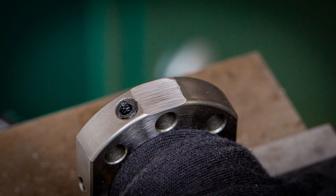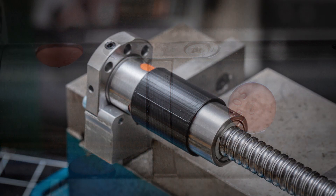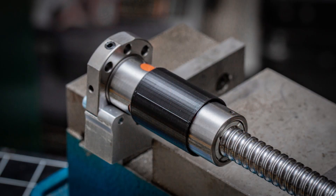Here you can see the double ball nut assembly. The two ball nuts are separated by a spacer that is ground or shimmed to provide a preload on the two ball nuts, making for little to no backlash. Here at the top of the ball nut you can see a key that locks the two ball nuts together. On my assembly that key kept lifting up out of the slot and wouldn't stay put, so as a fix I 3D printed a thin cylinder that would fit over the ball nut and hold it in position. It was a snug fit so it's not going anywhere. I mention this because you'll see this cylinder a little later in some pictures and I just wanted to explain what it was.